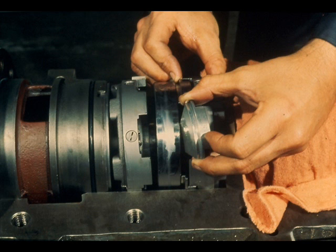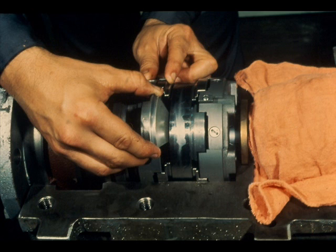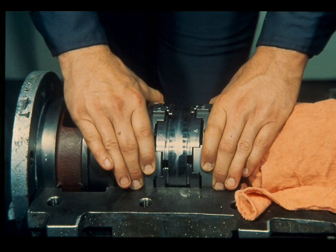Now install the remaining thrust shoes on the inboard side of the thrust collar, then install the shoes on the outboard side. The base ring must be rotated to accomplish this. It cannot rotate all the way due to the base ring key; however, the key will permit enough rotation to allow the shoes to be inserted into the base ring. After all of the thrust shoes have been installed, rotate each base ring until the base ring key is positioned to enter its locating notch.